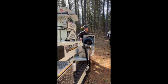It's broken down in this manual, but they want you to take this belt guard off, actually get a feel for that belt, make sure there's no debris build up on the inside of that. A lot of times, guys, a little chip falls in here, picks up into one of the grooves on the belt. Guys don't check it right away. It gets caught on that groove and it wears that belt and pulley down. You're just buying yourself new maintenance parts at that point. So about once a week, guys, just pop this cover off. They're all 9/16 bolts, just to get a quick little inspection on that belt, make sure everything's good to go.